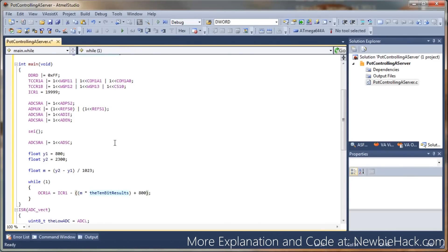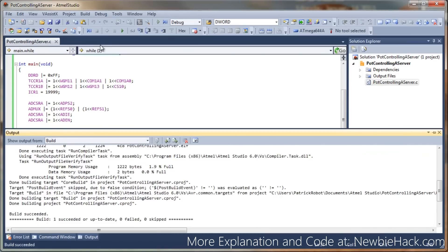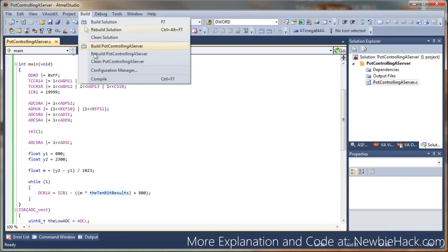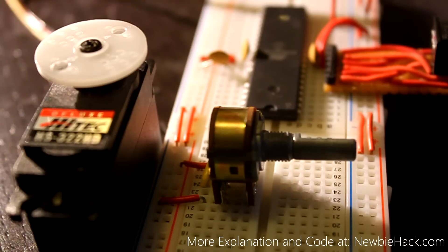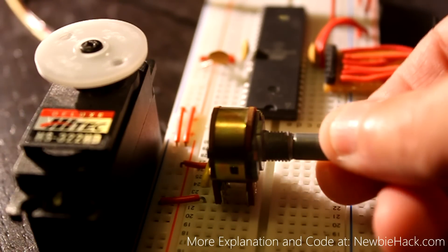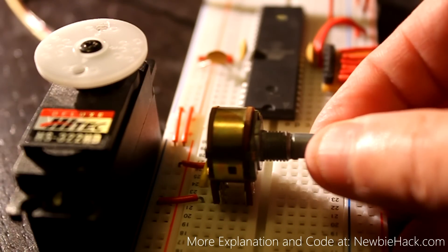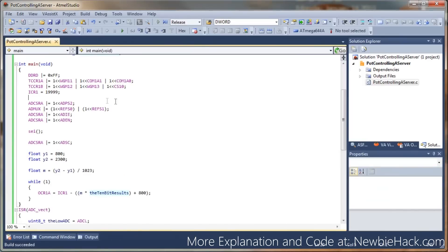This should work. Let's see if it builds. No errors — quite amazing. So let's try uploading it to the controller. I tried to upload it and it didn't work because I had it in debug mode and needed it in release. I'm going to build it again and then upload. The microcontroller has been programmed — it turns when I turn the potentiometer. I need to work on the extremes a little bit, but the program works. To adjust the extremes, just use a little trial and error, adjust these numbers, program it, and see how it works.